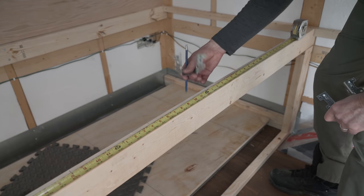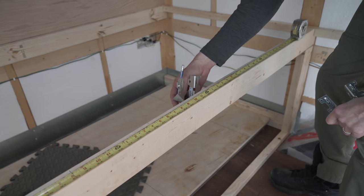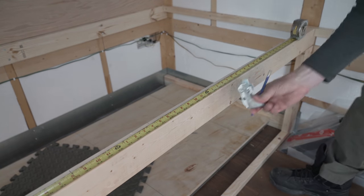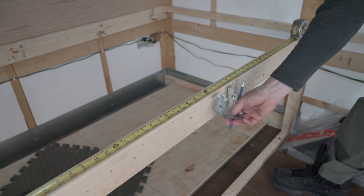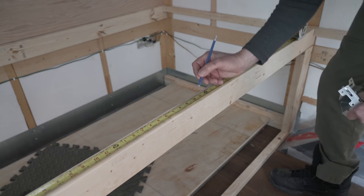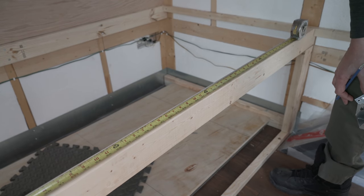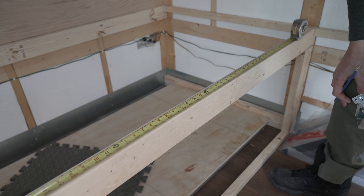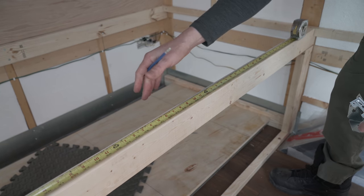I considered a few different things of how I was going to run the 2x4 joist across, but I'm going to use joist hangers, and I'm going to run them every 16 inches on this 2x4. I'll be hanging them on the other side here, to give you an idea. 2x4s will hang in there, with screws. These are super strong, and I won't have to put any more supports under the 2x4s. This is 48 inches, so we'll have a total of four of them, and this covers 80 inches, and I'm using 1/2-inch plywood. So that will be plenty strong to support that. And I may have these 16-inch gaps lift up to access some storage under there. I'm not sure about that yet.